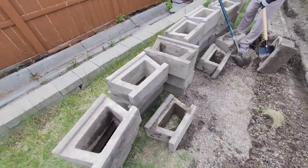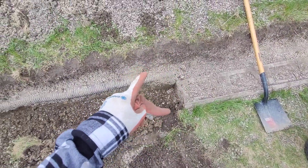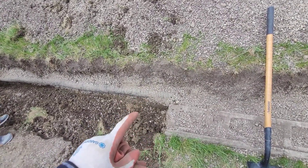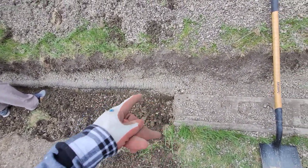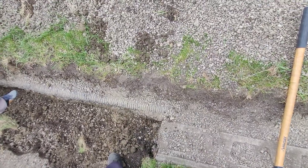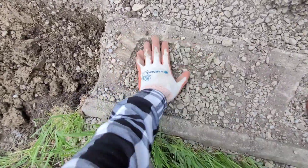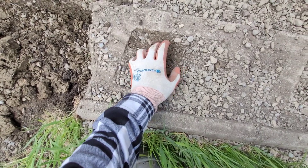We did some work here — quite a bit of the bricks have been moved out, that was the bottom layer. We actually found a drainage pipe in there, so this was more like a French drainage system. It's a perforated pipe or hose buried for draining water, but they didn't put any sock or landscaping fabric around it. So soil got on top of it and plugged it up — it doesn't drain any water anymore. There's still quite a bit of gravel mixed up with the silt and everything in the center of the bricks is so solid I can't even dig down anymore.